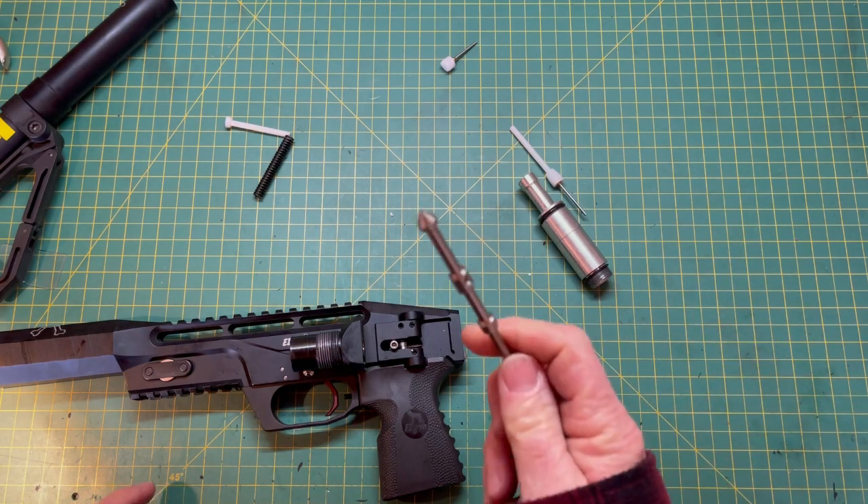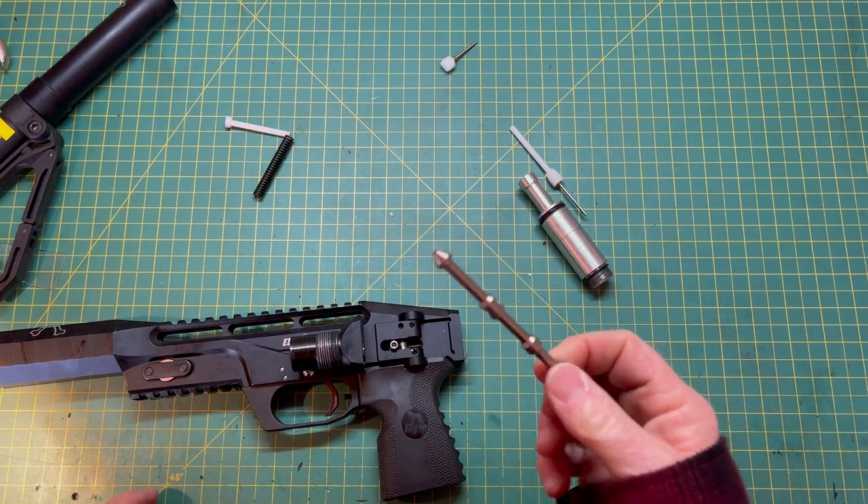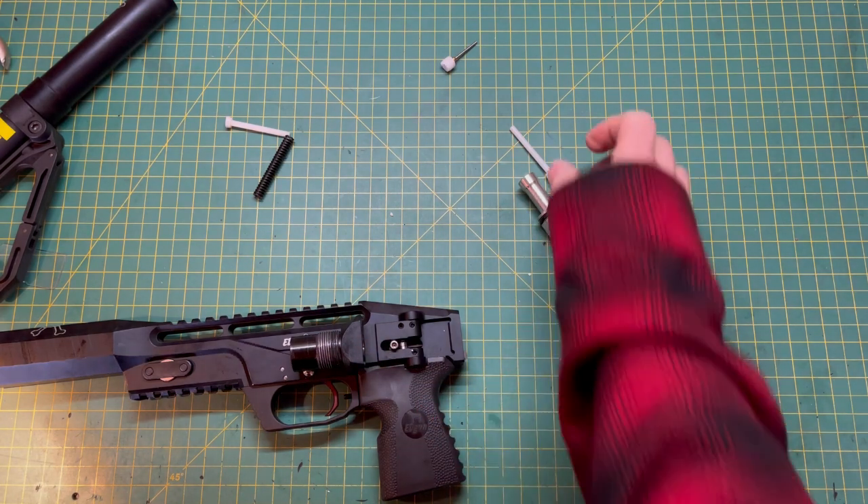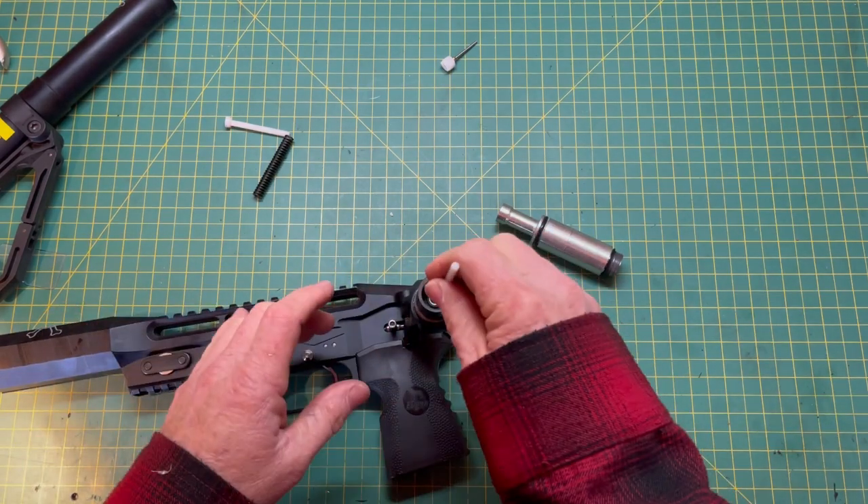If you don't have a serial number below 500, you have a regular valve. If you do have a serial number below 500, it works perfectly fine — just don't shoot the gun below 90 bar. I actually don't recommend ever shooting it below 90 bar in any case.